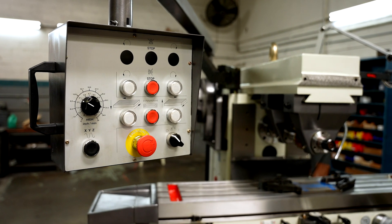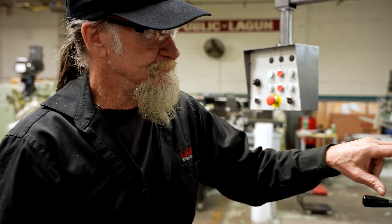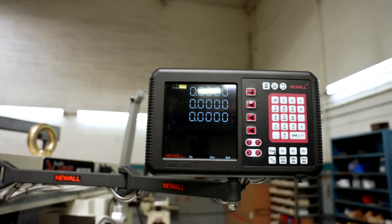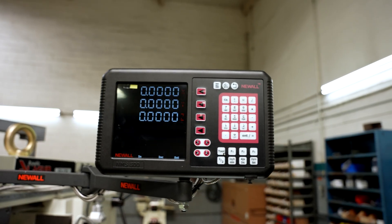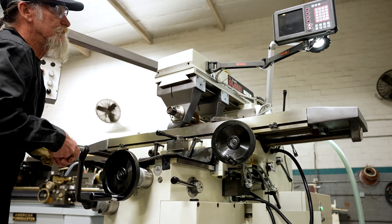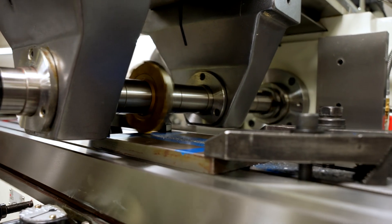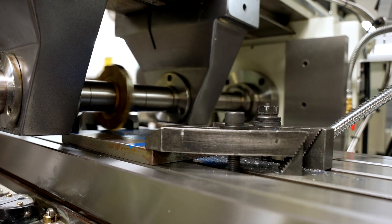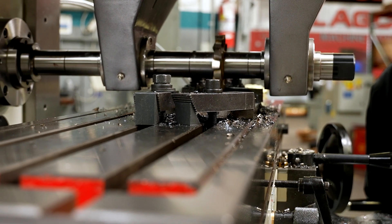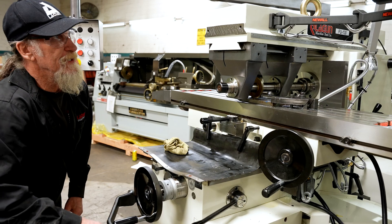We're going to start the spindle motor in the proper direction. I'm going to come to where I know zero is, then go ahead and feed upward another 3/8" of an inch. That will get my depth for my cut set — now you can hear it, it's made contact and it's starting to cut. Now I'm going to go ahead and feed upward carefully until I get to 0.375.